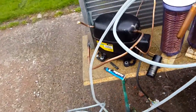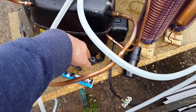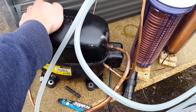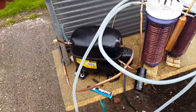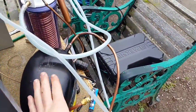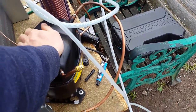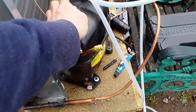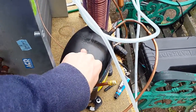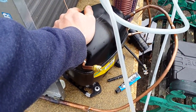914 watts — I think we're pushing this compressor a bit hard now. It isn't getting too hot though, so it seems to be doing not too bad. I think I'm running the evaporator a bit too warm on this. This compressor is not designed for this application — really, a big Tecumseh compressor is what I'm needing. The one horsepower ones can run their evaporator at minus 5, whereas this one cannot.